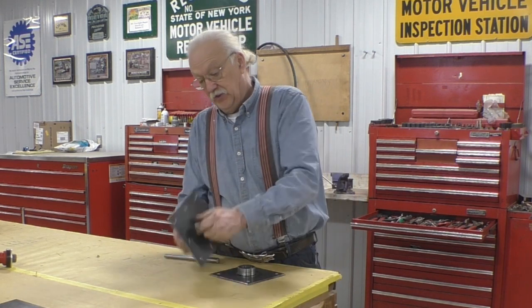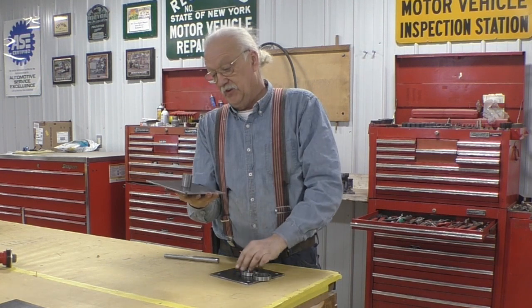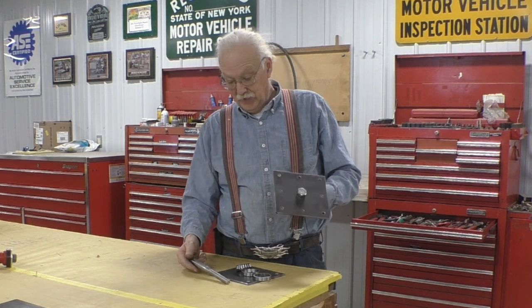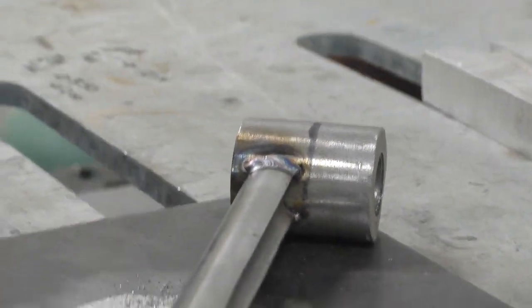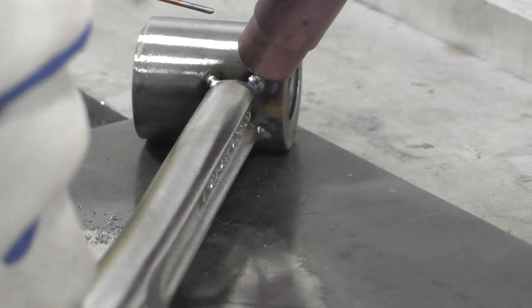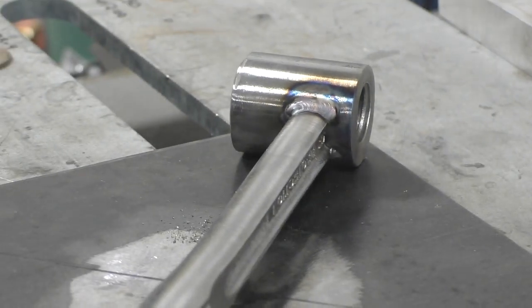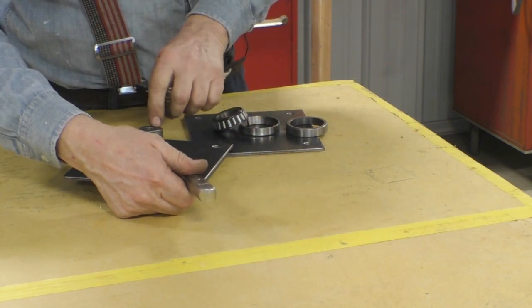So now we're left with one thing — how do we tighten this bolt? If this is up in a bearing and welded to this bearing here, it's up against the ceiling, so you really can't get to this piece to hold it and tighten the bolt. We have a nice old piece of history here — a Craftsman breaker bar that we cut off, and we're going to weld it so that it's outside of this piece. That way we can hold this piece and tighten that nut.